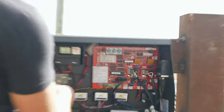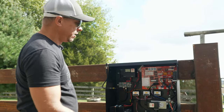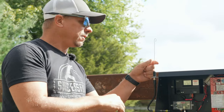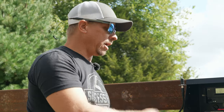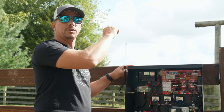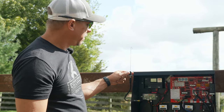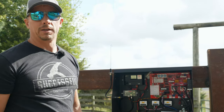They gave us 10 feet of antenna, which would be great if I needed to run it 10 feet away, but we only needed to get it above the metal. If you're installing one of these antennas, a key thing to remember is that it needs to be the highest thing around it — you don't want it down below all the other metal because it can interfere with its ability to receive signal. If it's sitting up taller than all the other metal, you'll have really good signal. We mounted it to the side of the cabinet, trimmed the cable, and used a bulkhead fitting to run it right through the cabinet and tidy it up.